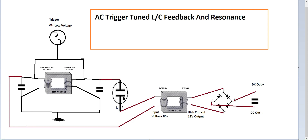If you understand how this works, you can go one step further and get really big power. For example, convert this transformer into a microwave transformer and replace the neon with a spark gap assembly. Now your switching threshold is going to be over a thousand volts. With the two circuits oscillating and the microwave transformer, the voltage will rise quickly over a thousand volts, so you're switching a thousand volts at perhaps one or two amps, letting the primary and secondary interact through the oscillations and tuned resonance.